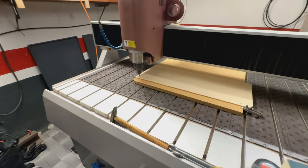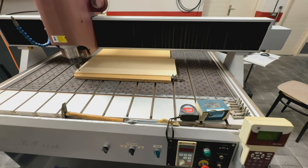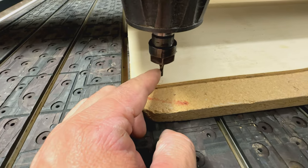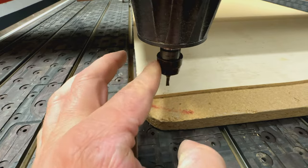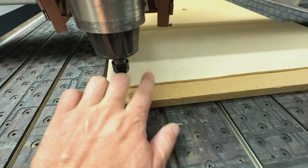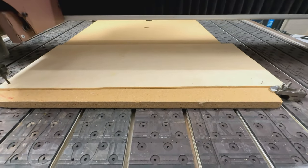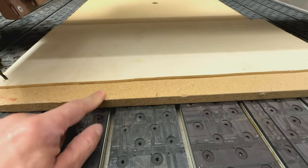And so for that I loaded a very basic shape, which we will cut out with this 4 millimeter bit, yeah. On a really high RPM, I think around 20,000 RPM or something. So the depth of the cut is not more than 5 millimeters. So this is the thickness of the material. What is the material? I just found some garbage wood here in my storage. And I placed down there another piece of garbage, which I found in a container.